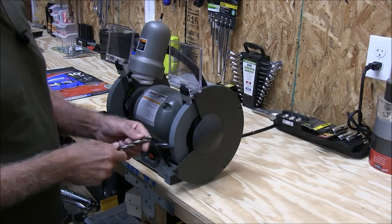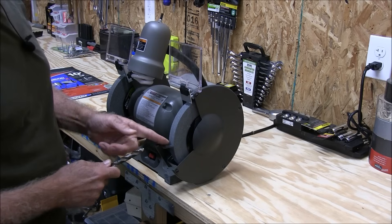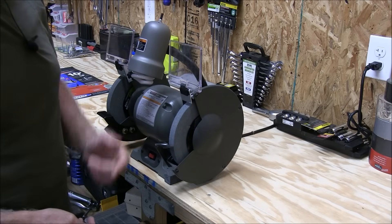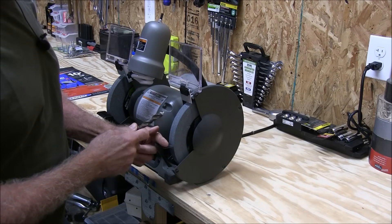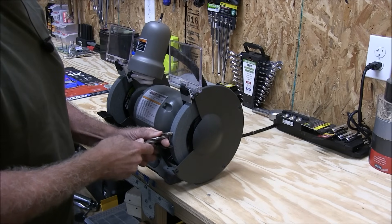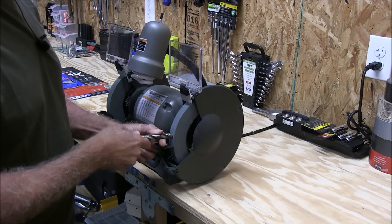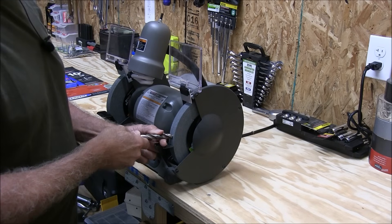What I do is put my finger just above center to rest the drill on. The angle this way is not super important as long as they're equal on both sides — that's the important thing. So make sure you're above center. You've got a little notch here for it, but from experience, you want to be just a little higher. I rest the drill on my finger and roll it into the wheel back and forth until you see it's grinding the cutting edge. I grind that three times — one, two, three — then flip it 180 degrees and do one, two, three on the other side.